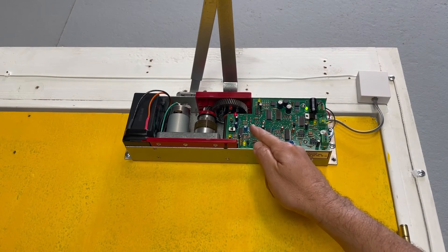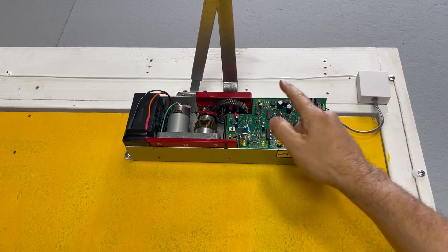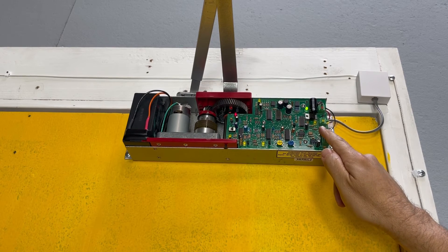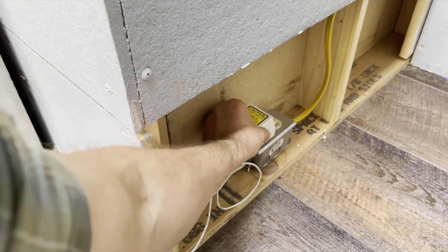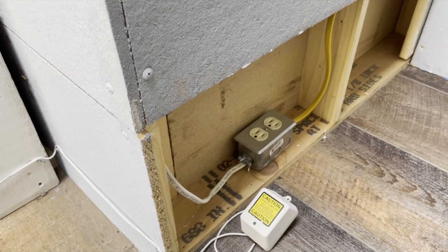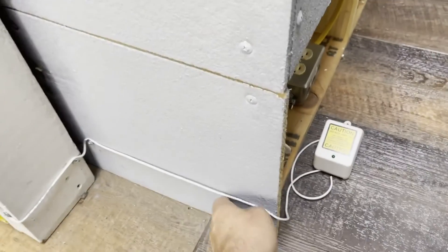The red light and the green light. The red light tells you that the door operator is in the closed position. The green light tells you that the unit is receiving power to charge the battery. If the green light is not illuminated and your transformer is working, then check your wiring. Turn off the door operator and unplug the transformer. Then check the wires to make sure none are loose or pinching. The door cord from the operator could have gotten pinched, or one of the wires from the transformer to the phone jack may have come loose.